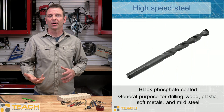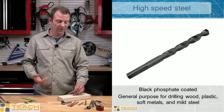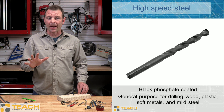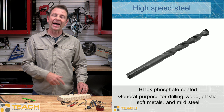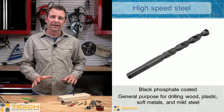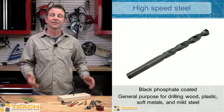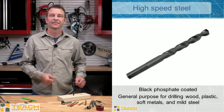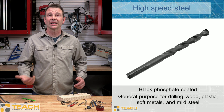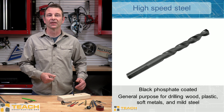So that's some of the parts and the points of a twist drill bit. Let's look at the materials that they can be made out of. Here you see a typical high speed steel drill bit — this is your sort of base model. This is black, meaning it's phosphate coated with no special coatings. Nothing fancy or high tech about this bit. The most common, most reasonably priced bit. You would typically use this for soft materials like wood and plastics. It can even cut some mild steel as well if you use a little oil.